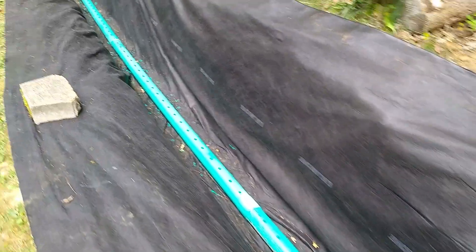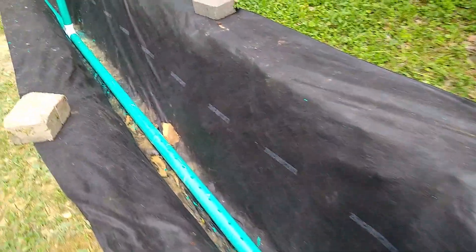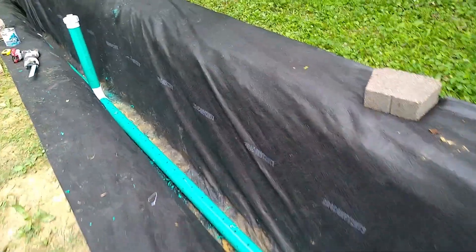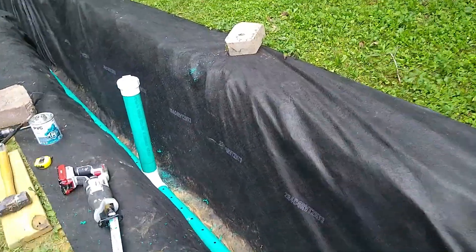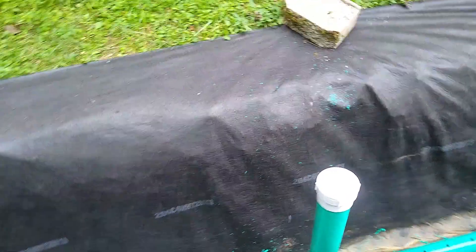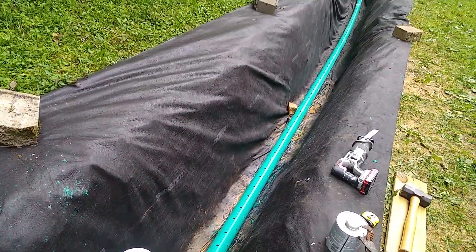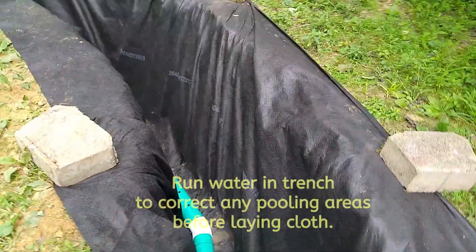This pipe is four inch, and the two holes in the bottom sort of make like a trough. They kind of carry the water, so the water is going to rise up in the bottom and then go into the pipe if it gets to that level. This is one of the clean outs. I decided to go with a really steep grade on this because I just wanted to be able to carry it out, flush it, and do it fast.